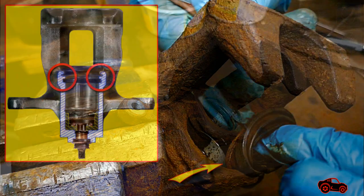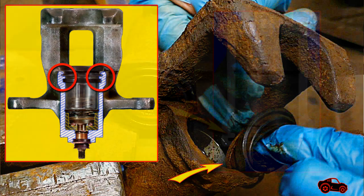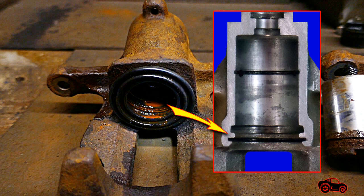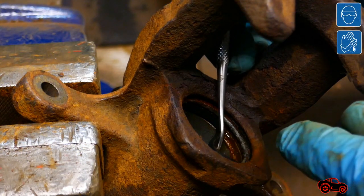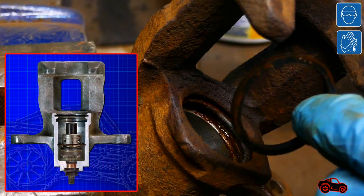So after a while the rust can accumulate in cylinder grooves. When it happens the seals are compressed against the inner surfaces and the piston can seize inside the cylinder. Normally with a pick tool a piston seal is easy to grab from the cylinder.